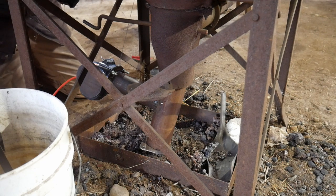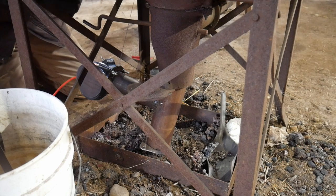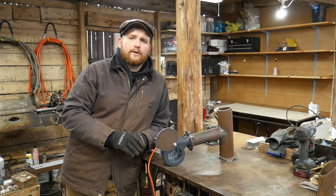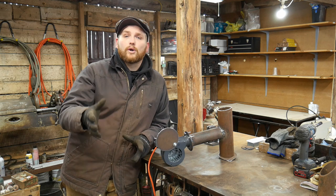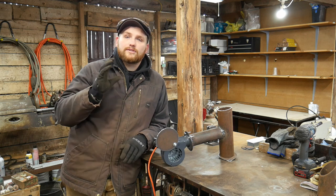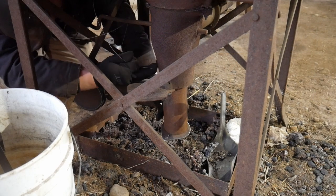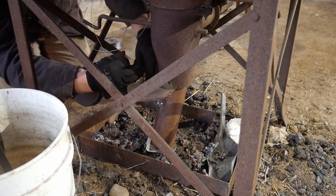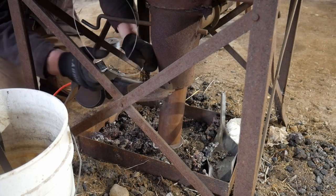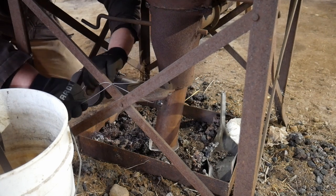It keeps a really nice short hot fire. No sparks or embers or anything like that that you might get from, say, a charcoal fire. It just works. End of story. Gets plenty of heat out of it. Coke is awesome for that. It's very clean running. But this blower here will be perfect for my application, and it's a lot quieter. You can just barely hear it run in the shop, and that's what I need for filming work.